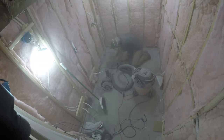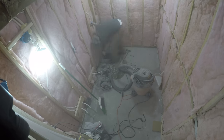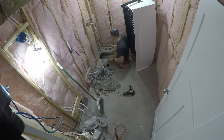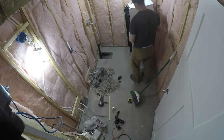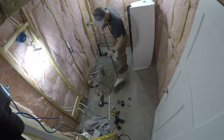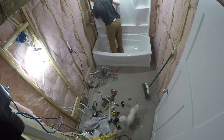This is quite a bit of work so I used a jackhammer, a sledgehammer, and a skill saw with a diamond blade to cut through the concrete and make the scoring needed to knock it out. There was a lot of trial and error — basically I'm trying to get the existing plumbing hooked up to a bathtub drain. There are two parts that need to be drained: both the bottom and the overflow valve. I'm working with two-inch ABS pipes, putting some glue, testing, and getting everything set up.